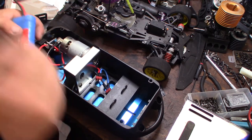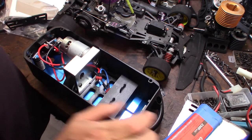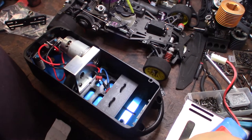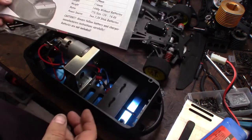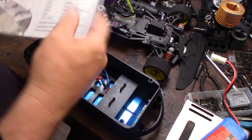Another option is to use a larger single battery. As long as it's 12 to 14.4 volts, I don't specifically have to use two battery packs — I could buy one large 14.4V cell pack, or even make one out of 18650 cells. That kind of sucks but we'll keep going with the review.